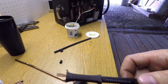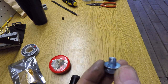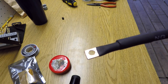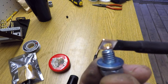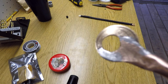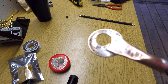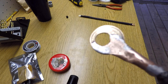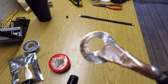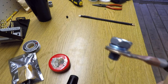You can take a match or whatever you've got — I like to use a heat gun. Here's a bonus lug for you guys. I needed one that could fit a 3/8 inch bolt, and the ones I was making out of the 1/4 inch pipe aren't big enough for this 3/8 inch bolt. So here's one I made using the same method, but out of a copper penny. Since this is educational I can do this without getting in trouble for destroying a penny — and it's only a penny, way cheaper than buying one. I just took that piece of copper pipe, split it with a pair of shears, cleaned up the inside, clamped it onto my penny, and then drilled my hole for the terminal. Then I'll run my heat shrink up there.